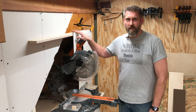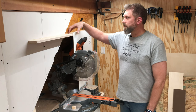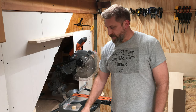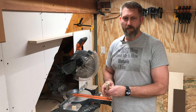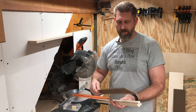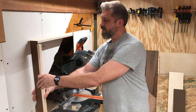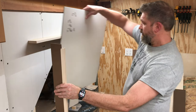I've cut the whiteboard panels to size and shape, and installed this piece here to take up the space between the wall, the box, and the panel. I also needed to fill in the gap along the side. What I decided to do was cut grooves in this piece of maple — one groove to receive the white panel and one for the side panel. So it'll just go in here; it's not super snug but not super sloppy either, and that fills up the space and gets this panel in place.